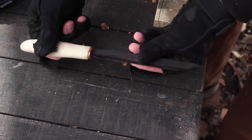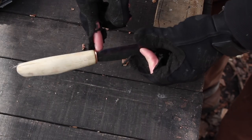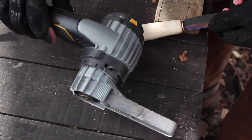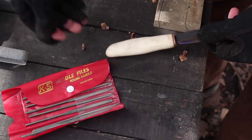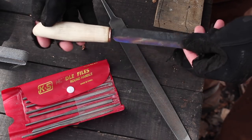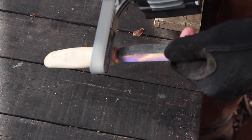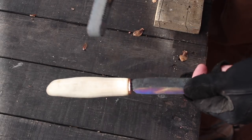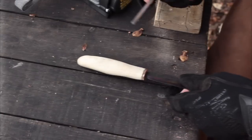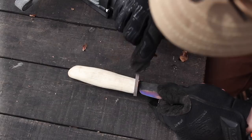The glue has cured for a couple days and the blade is successfully secured to the handle. Now I'm just going to clean up the copper where it meets the wood of the handle — I'm probably going to use my Work Sharp grinder for that, but you could also use the same little files or a mill bastard file. This also cleans up any of the glue that got on the handle. You could also use your little files — especially on the copper; I probably wouldn't use the grinder on the wood.